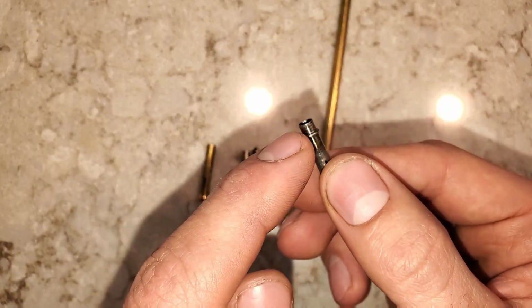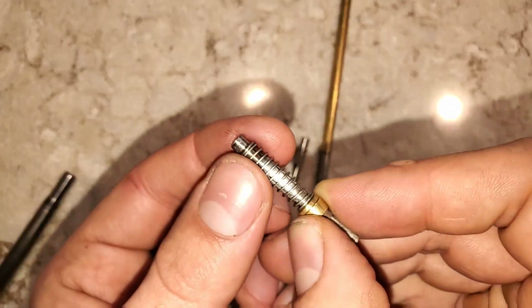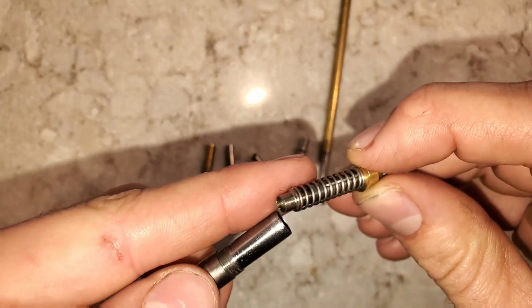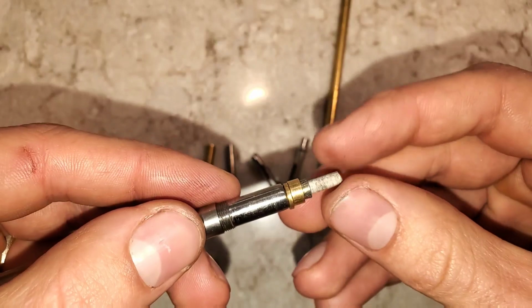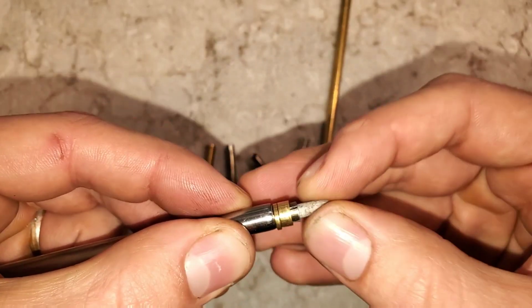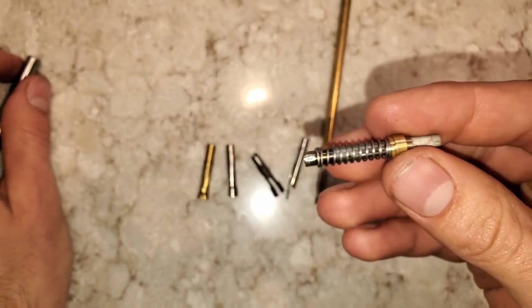Additionally, this has this larger groove. This protruding ring is important because it interacts with the ledge inside of the threaded coupler. That means that the eraser mechanism can't slide back any further at some point. It has a positive stop here.